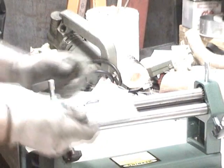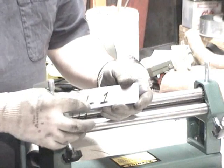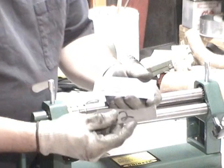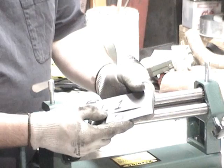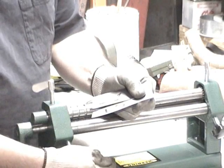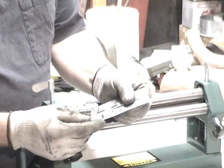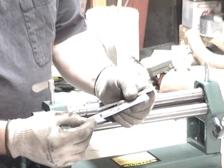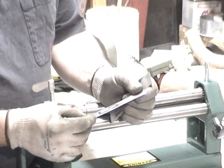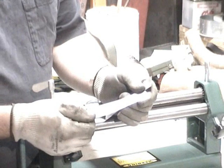Now we're going to show you how we roll all these pieces. We've got them all cut, and one of the things I do to make things understandable so you don't get things mixed up — when I write my numbers on there, it means that as you stack them, when you go to stack one on top of another once these are rolled, you want to be able to read them so that they stack from L1 being the top of the pipe where the flange is, going all the way down to the end of the pipe. The length of one side is just a little bit longer than the other, which causes the mitered taper of the piece. It might not sound like a whole lot, but it's only a difference of maybe one millimeter on a lot of these pieces. Once you've got it rolled, it's not always very obvious which end is which, so doing it this way helps.